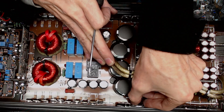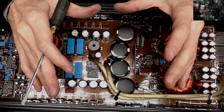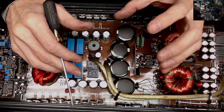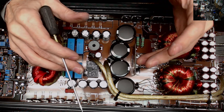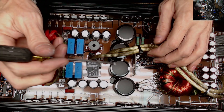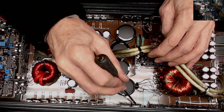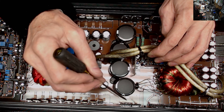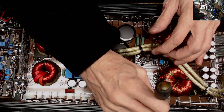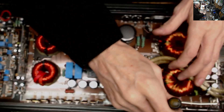What usually happens is you're pounding away and the amplifier is under extreme vibration, things start coming loose. Those little jolts — where the circuit opens and closes really fast — create a lot of current and destroy everything past the point of the issue. This is basically not a rail short, but a lack of rail voltage, sending one side to a low voltage condition.